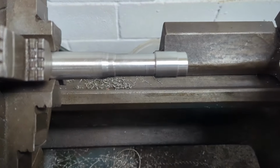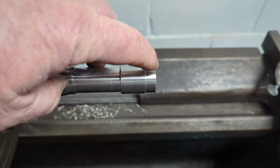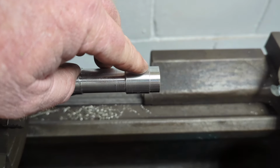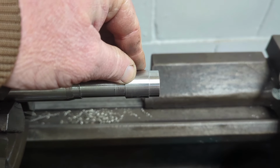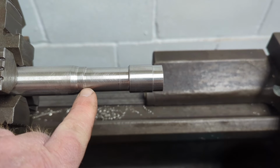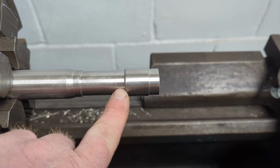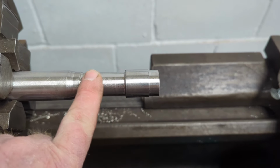All right. So I started cutting it back to the 810 thousandths, excuse me. And got to thinking about it, that the more mass I have here would help lock the head in. So I came back, I measured from where the bottom of the form will fit up to clearance. So that was 1.5 inches. So we got that milled down to 810 thousandths.